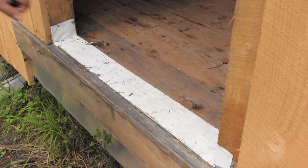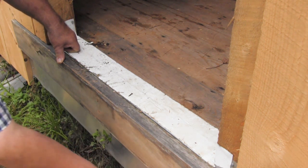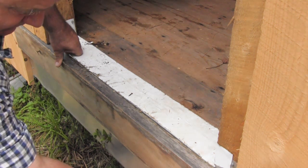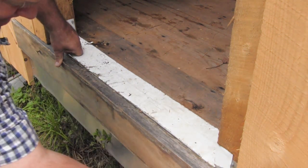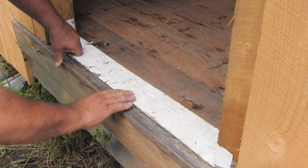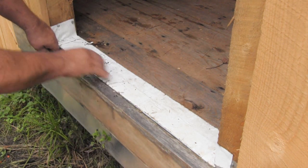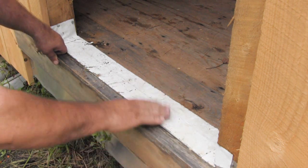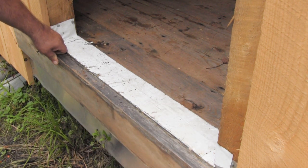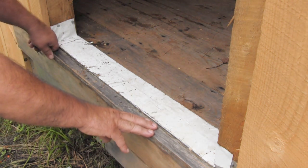Here's what I want to show you. The 6x6 runs in here — we got the floor joist, then the 6x6. I coated the 6x6 and the floor joist with kerosene and motor oil. Then the flashing runs all the way up and folds over behind the wall boards. Right here is the ice and water shield tacked over the flashing. So when water comes down here, it'll run right down to the ground. To me, this is the best way to finish these doors off because this is the weak link in the cabin as far as rot goes.